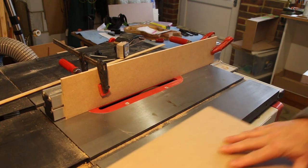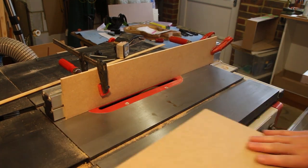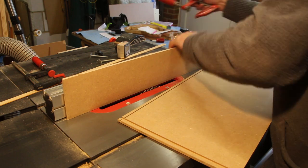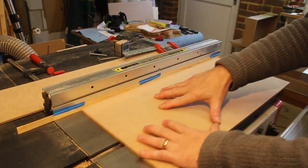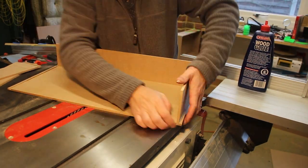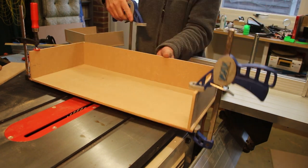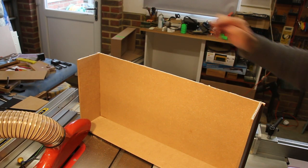I also need to run a groove along the back of these boards in exactly the same way. I've added a little bit of blue tape just to stop this from falling off and hitting the blade. That'll just keep it safe — the blue tape is above the height of this board so it shouldn't get in the way. I've dry fitted the back and sides of this tray. Now I'm ready for glue up. I then glued the front on using some weights as clamping pressure. I'll come back and add some additional bracing once this has dried.